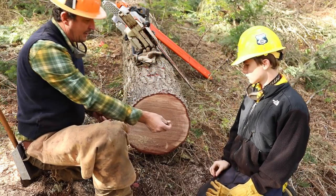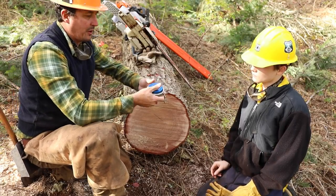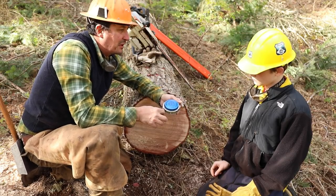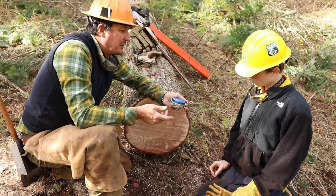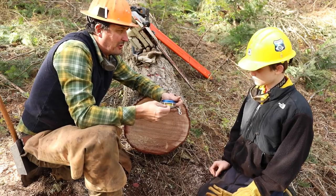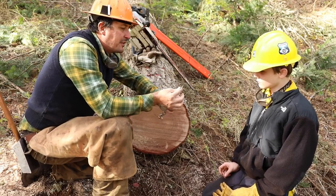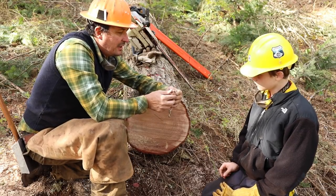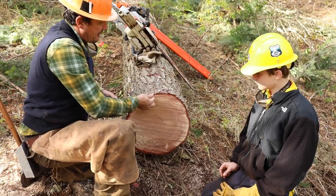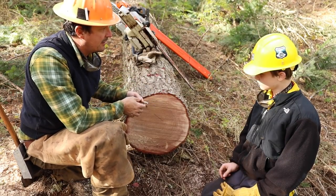It is a 16-incher. Now, this is a Spencer logging tape. You've seen me wear this around. These are really wonderful tapes. I first found these when I was doing excavating and I was working in the mud. I couldn't find a tape that would last more than a week or so, and this is the only tape that I could ever find that would last year after year after year. I didn't even know that they were made for loggers back at the time. But it's a 50-foot tape, and what we do is we take a horseshoe nail, and that right there is a horseshoe nail bent over. The reason for that is when you start taping this, you can stick that horseshoe nail in there, and it'll hold, and when you get to the other end, you give it a yank, and it'll pull out, and you can get your tape back, right?